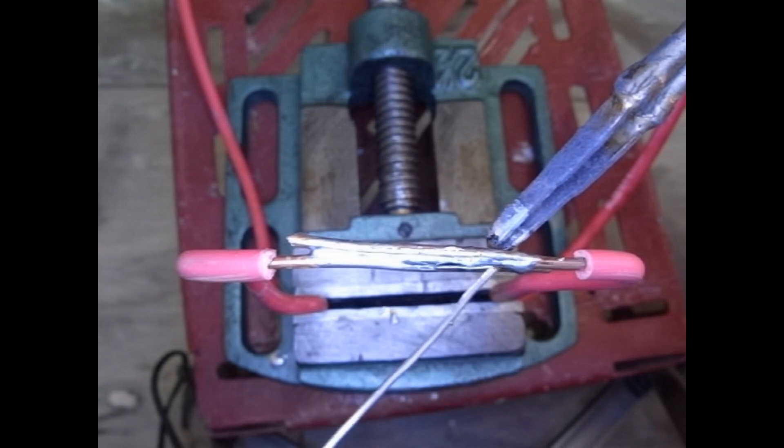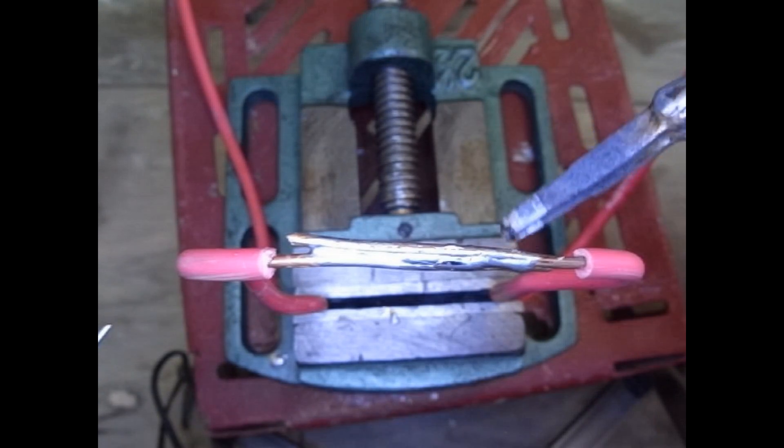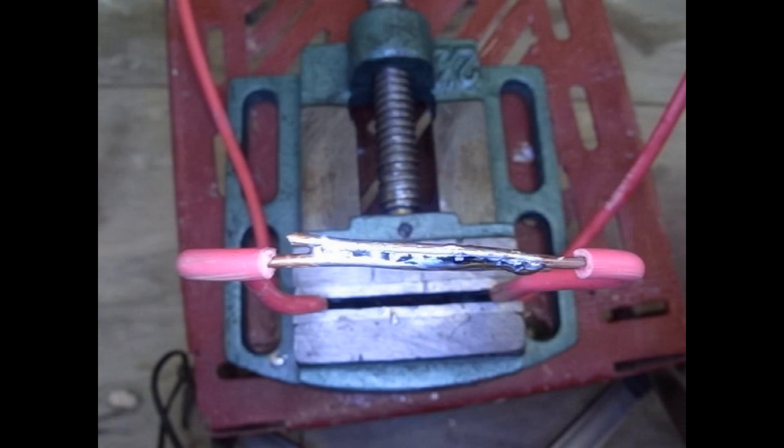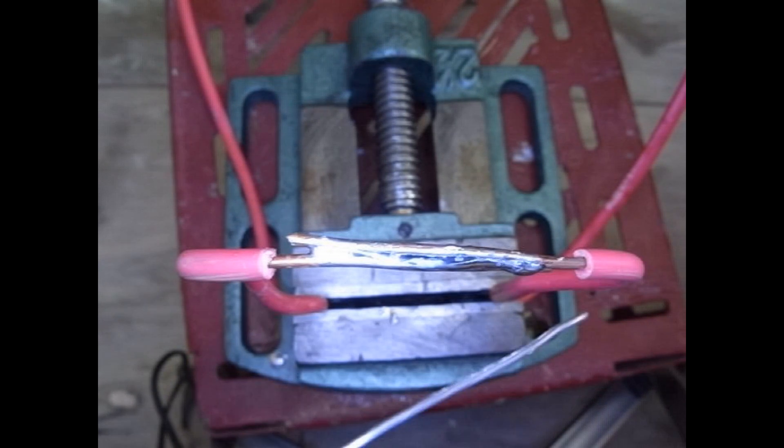This is not a lovely joint. But if I take my time and get the solder to flow, heat both sides of the work, and continue on — for just a plain old joint like that, if you move along slowly enough and apply enough heat, you can make even a really bad joint like this work. So your technique and how fast you move is also important.